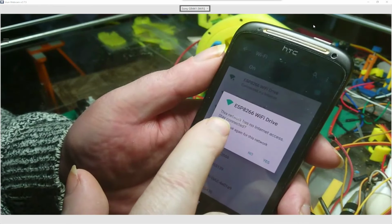And then what we've got at the bottom, or if I can get that in shot, well, I'll show you when I do the web page on the PC. But basically there is some feedback from this little chip. It'll give you the exact spot it actually did stop, which is 0.42 degrees. I've got about half a degree slack there. It's all a dry joint. I'm not using any grease, so I've left things a little slack. I'm quite happy with that half a degree for what I'm going to make this harmonic drive for.